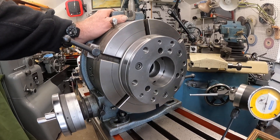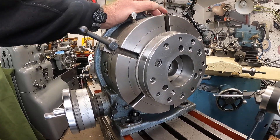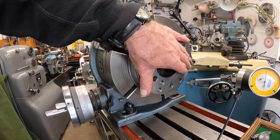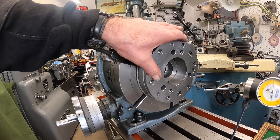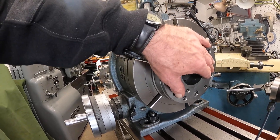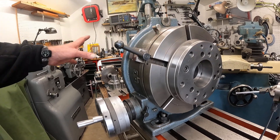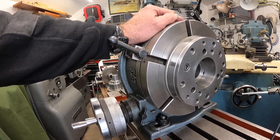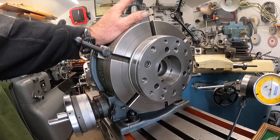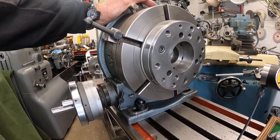I've used this rotary table instead of a dividing head for years — I had a small indexing head but this thing filled the bill. I've got the plates and so forth. I can bolt the three-jaw chuck on here, and I have an adapter plate where I can put the four-jaw chuck on too. I'm going to adapt the Bostar collet chuck to this so I can use all those chucks on both the rotary table and the dividing head, in the milling machine and jig bore. I'm sharing tooling — I just use adapters and save a whole bunch of money.